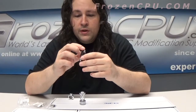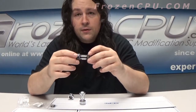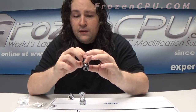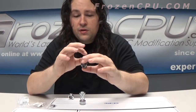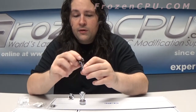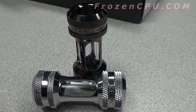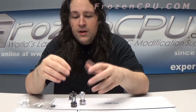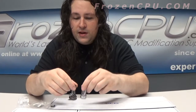It's going to look really cool. The screens they give you are small screens. I generally take the bigger screens out of mine if they have both — the bigger screens are only good for huge chunks, and most of the chunks you get out of radiators are quite small, so the smaller screen is better. A lot of people worry about using opaque coolants with these — I use opaque at home with filters, it's not a problem at all. Filters do restrict flow to a certain amount, so keep that in mind.